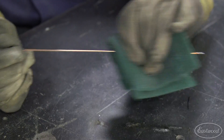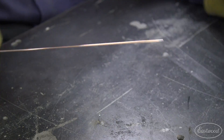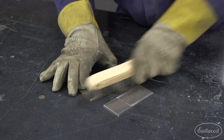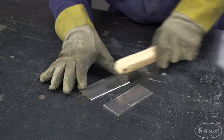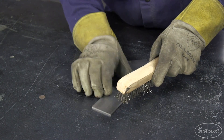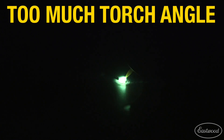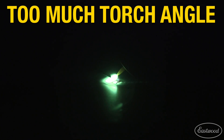Make a practice also of cleaning your filler rod with a scuff pad and low VOC pre or acetone before using, for the same reason. Use a dedicated stainless brush or scuff pad for TIG welding prep and low VOC pre or acetone for your final clean when welding. Make sure that the torch angle isn't too excessive as the welding gas could blow ahead of the puddle instead of over it.